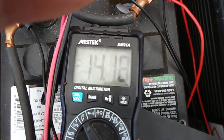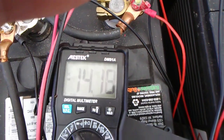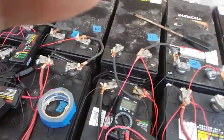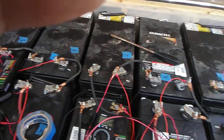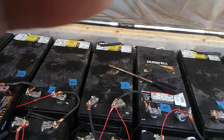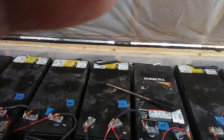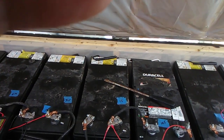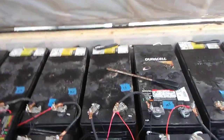And here we get 14.16 — that's actually a little low; it should be more like 14.45. So I do have a battery in here that's starting to go weak that I'll have to replace eventually. It's not real bad right now, but judging by how fast I saw my coulomb meter jump from normal to like 20, 30 amps difference, that battery right there probably doesn't have much lifespan left in it.